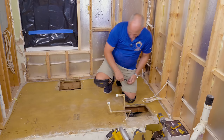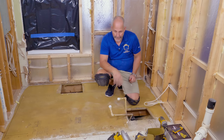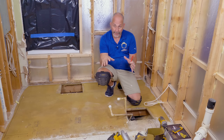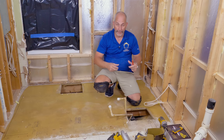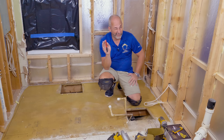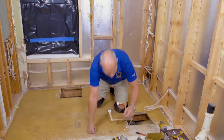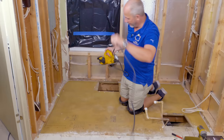We're going to put a new elbow on, bring it straight up, and we'll need to buy a tub filler that will have to be framed and boxed in. I can't do the water supply until I have the tub filler on site, because there's a multitude of different installation systems — some just leave a hole in the floor with a plate that screws down, some require framing inside a box with NPT threaded fittings. I've seen it done more than four ways. I have to order my tub and tub filler, but in the meantime I need a plan — you've got to know the end before you start. So let's cut this open and have a look.